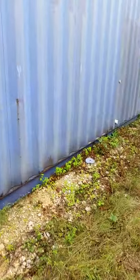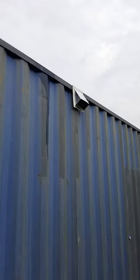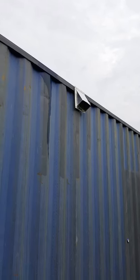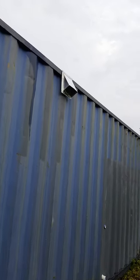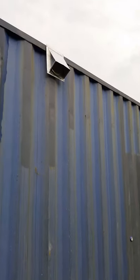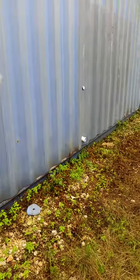I'm walking through here a bit cautiously because there are a lot of spider webs — I don't want to ruin their homes. Here's the vent exhaust: it's a 140 CFM exhaust fan, one of the faster ones for a small bathroom space that's going to be moist. It also had a 1.5 sone loudness rating; others had a 1.0 rating but didn't have as much air movement, so we went with this one.